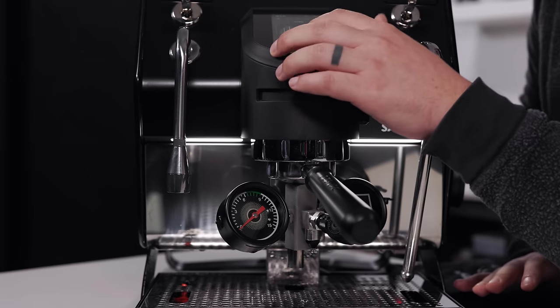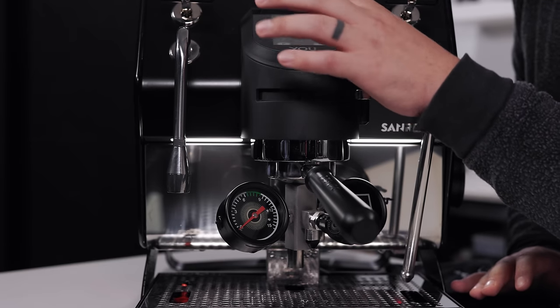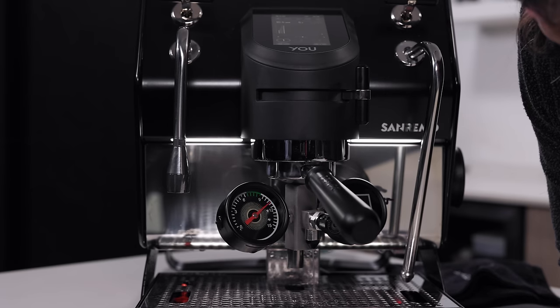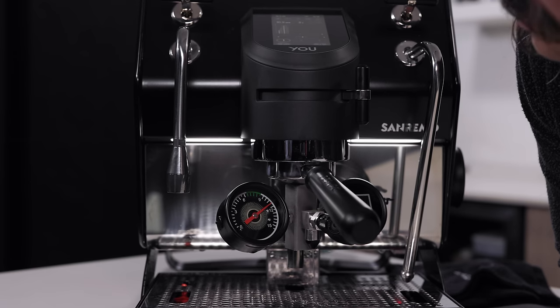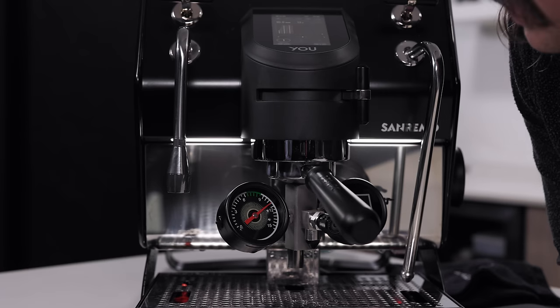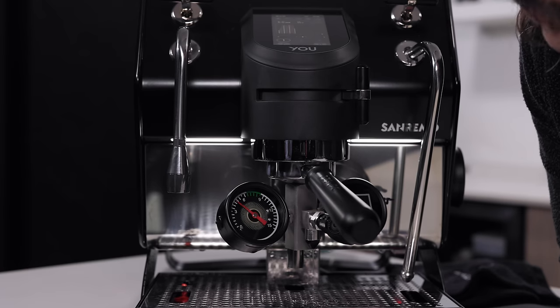I'm gonna just put the valve where it's somewhat open. It should be able to react to wherever the valve is, as long as it's not so loose that there's not enough flow for the pump to achieve it. Anyway, we're gonna go ahead and hit 1 here, and we're gonna see what happens. So we start off, it should go up to 12 pretty quickly, and there we go. It got up to right below 12. It's at 11. It's hovering at 11. And we're at 3 mils a second. Now we drop. We're dropping.